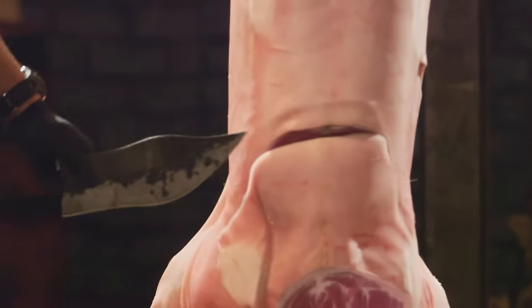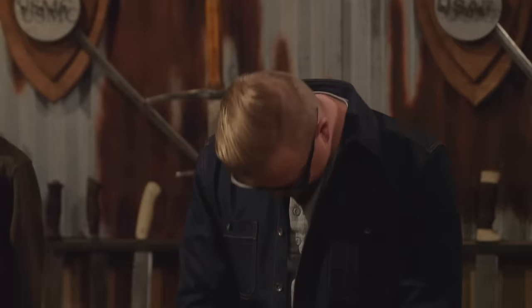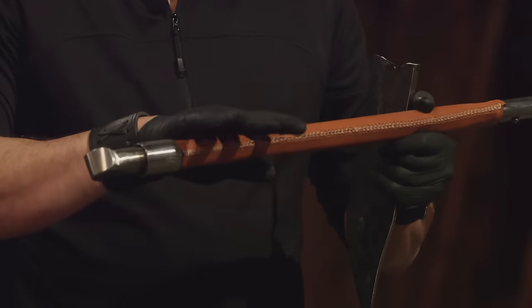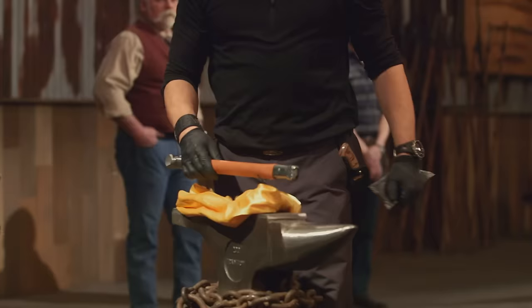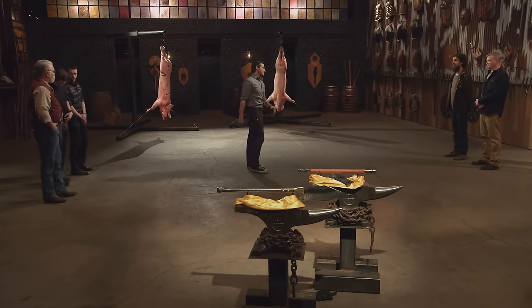Sorry, man. It's a big piece of shrapnel. Damn it. Well, Benton, one of the things I like about this, you put on the leather, it gave me a very nice area to hold onto, and it's ovoid. I can tell where the edge is. But the obvious happened. It's a coarse grain structure here. I should have normalized that tang much better than I did. But when you're grinding away long days in the shop during this challenge and you're just focused on the finish line, it's easy to overlook some things, and obviously I did.